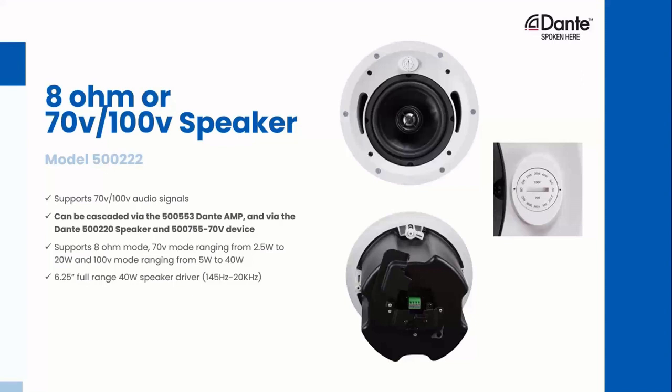It can also be used with the previous column speaker we just saw, which has that 8-ohm output I spoke about. You can see here on the far right there's a dial where you can dial in 8 ohms, or you can set it up as a 100 volt speaker or as a 70 volt speaker, and you have drop off wattage settings to drop off a certain amount of watts onto that speaker. You've got an in and an out so that you can chain multiple speakers together from a 70/100 volt system.